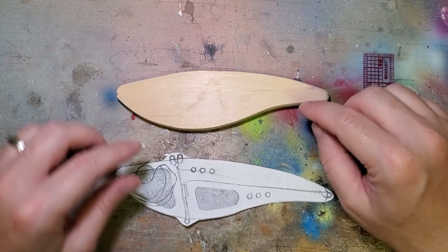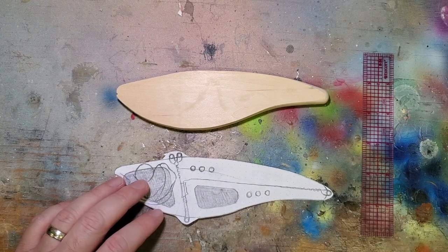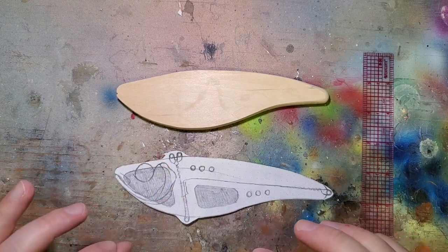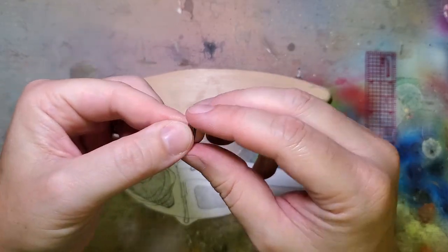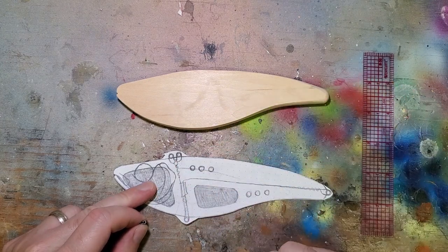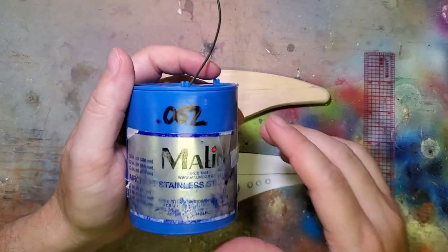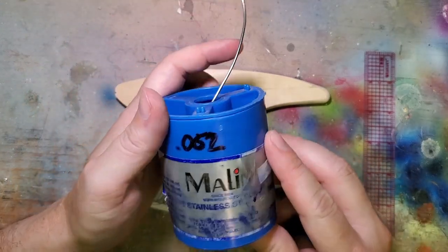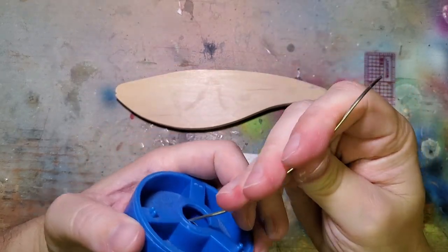I'm at the point now that I'm ready to make my through wire, and I'm gonna change it just ever so slightly. I'm gonna use these little double barrel crimps. I've already had one here, but I'm gonna use one in all three locations just to make my job easier. I can twist that, but I'm gonna be using this 0.062 inch stainless steel lock wire, which is a lot stiffer and harder to work with.